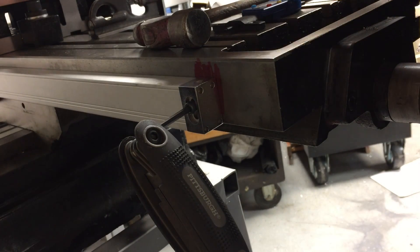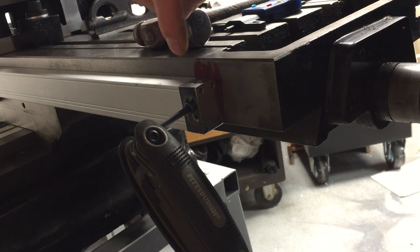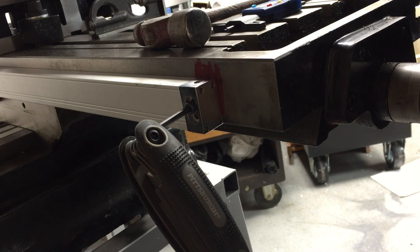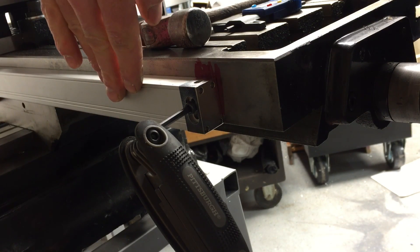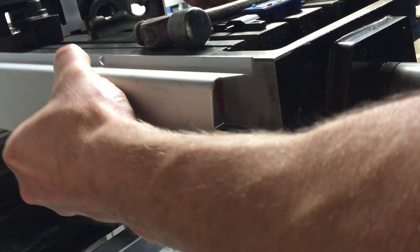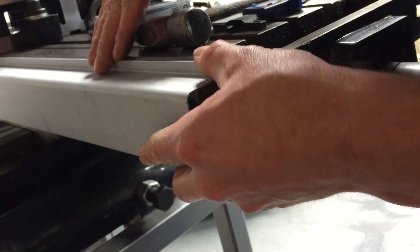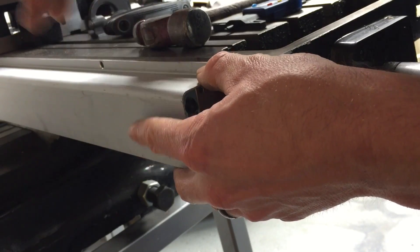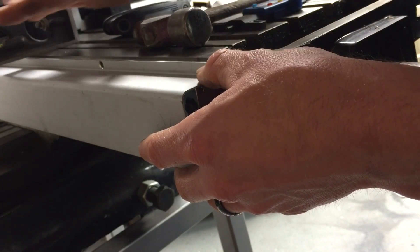So you're on the backside of this now. I'm mounting the X scale and I've basically located it on here. The big thing is you want to have your scale centered on your table. Make sure you leave enough height for this, because you would not want this to be above your table — if you have something that's going to extend past here, you can't have it flat.